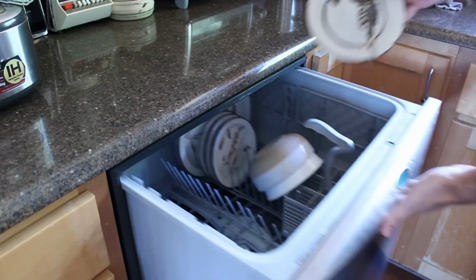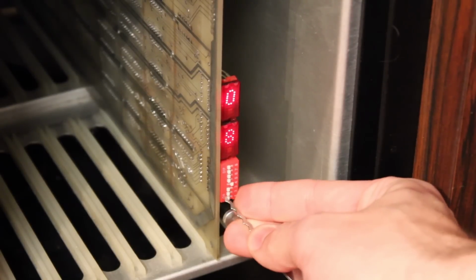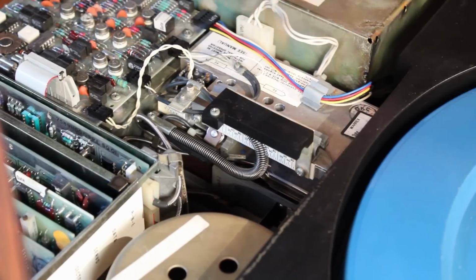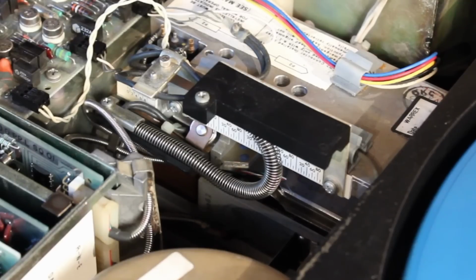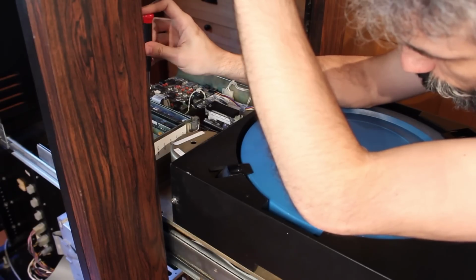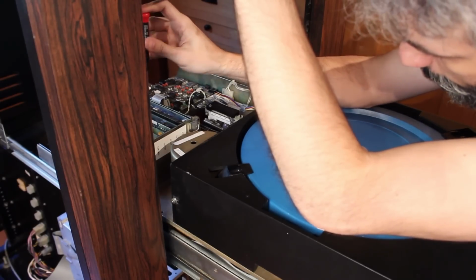All right, now that my stomach is full and we've been purging the drive for a while, it's time to get the diag card set up to the Hawk read test. Then we need to hook the head actuator back up, and we need to spin the drive up and wait for it to load the heads. And then it's time to get it to try and pass the read test, and well, I'm still getting read errors, unfortunately.